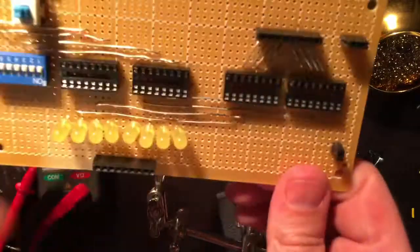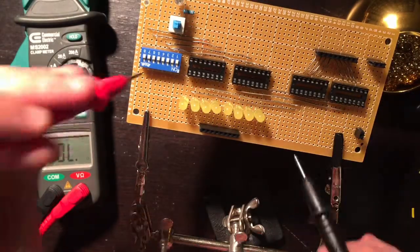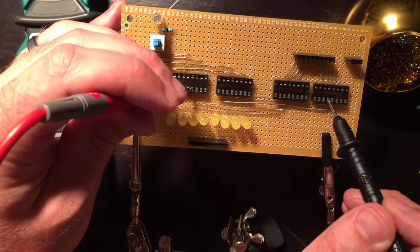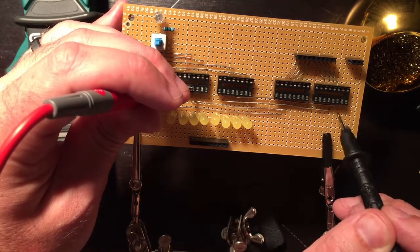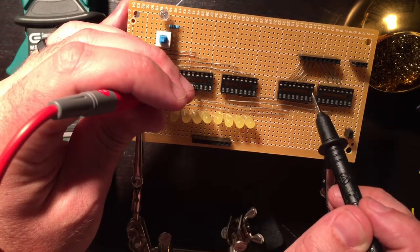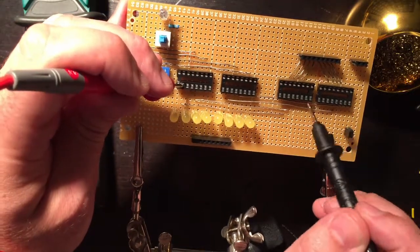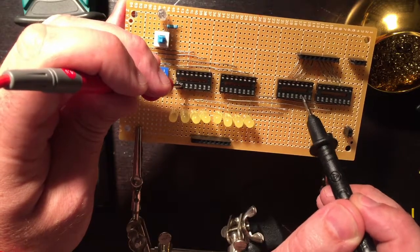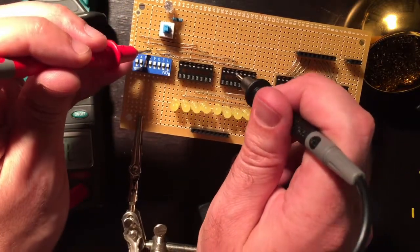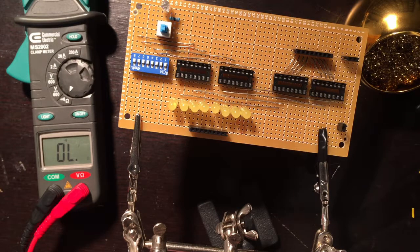So I think if I check, just to double check to make sure I know what I'm fixing. According to this, I connected bit 5, which is here, to bit 6, which would be 1, 2, 3, 4. Fourth over, 1, 2, 3, 4. Yep. Yeah, so 6 and 5 are flipped. And this should connect to this. Yeah, and this to this. This to this, and this to this. Okay. Wow, not bad at all. One flip, so let's fix that right quick.